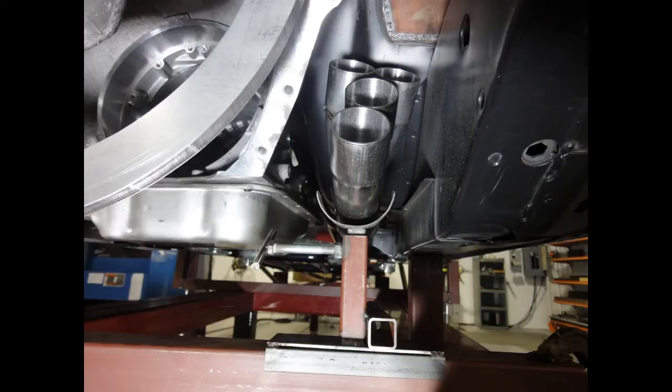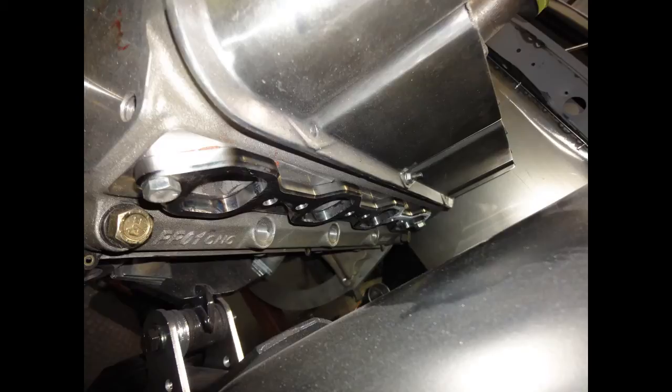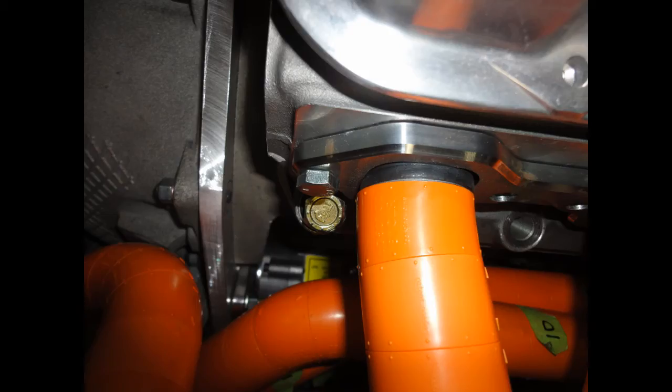After that one is mocked, we proceed to make the other three the same distance by manipulating the tubes with different turns and angles to try and match the same length as our first. We have the flange bolted to the cylinder head and we are ready to go. You can purchase straight starter tubes coming off the flanges if the clearance allows. In our case we have squared ports and very limited space, so Lou opted to fabricate his own. They are all made in one-inch increments so you can count the pieces to know you have equal length tubes for each cylinder.